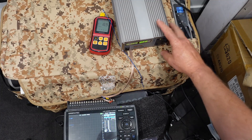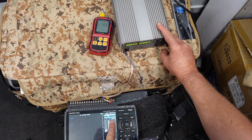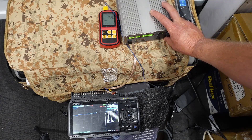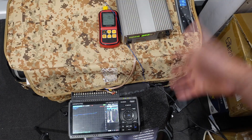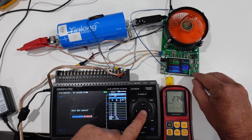Now we'll charge it when it's cold and see how it charges, how much capacity goes in, then warm it back up and see what we get out. The cell is at minus 17 degrees charging at nearly 2 volts. Getting close to 2.8 volts at minus 15 degrees — and there we go. While it was cold it absorbed 41.06 amp hours on the charge, very similar to when it was warm. The power released from it when warmed up was basically 41 amp hours, giving a total round-trip efficiency of 94 percent — still quite a good return efficiency.